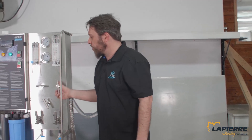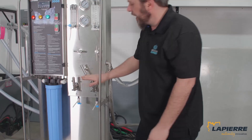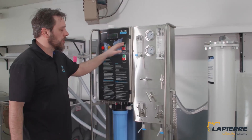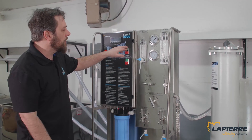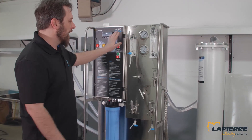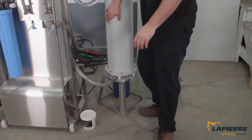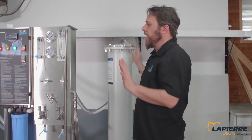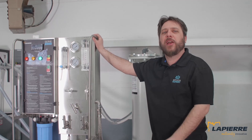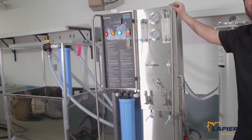We're just going to start it. Of course, a rinse is always done on wash cycle. I'm putting my five-way valve back to drain — rinse goes to drain. We'll start the RO now. It should start easily because it was well-primed. I'm going to make sure recirculation is running — I can feel the shaft under it. Everything is well in there. We're going to let it run like that until it draws the entirety of the tank.